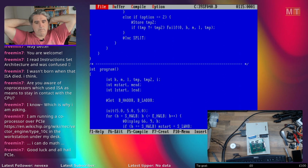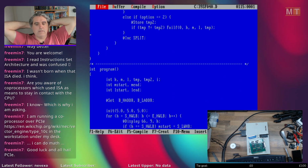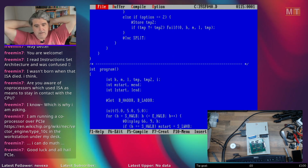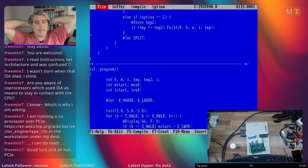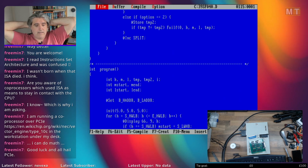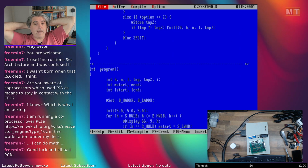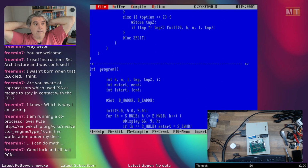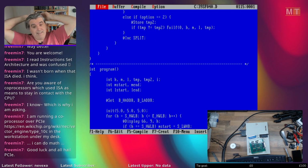Another possibility: because it is just a simple 8-bit data bus, a few address pins and a couple of control signals on the DB25 connector, there's no reason why those signals couldn't be created artificially by a microcontroller, and then have an adapter that plugs into USB to be able to control this from any computer with USB. That even would be a possibility.